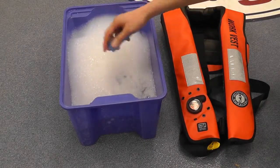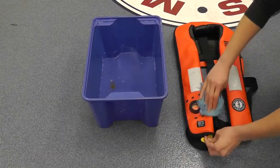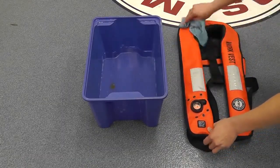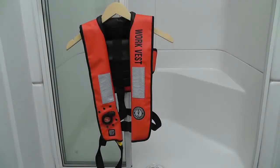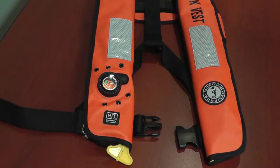You should also take time to clean your PFD in warm soapy water. Rinse the PFD with clean water. Do not get the inflator wet. Hang the inflatable PFD to dry on a coat hanger. Do not dry clean. Do not use chlorine bleach. Do not iron or dry with direct heat, and always store your inflatable PFD in a dry place out of direct sunlight.